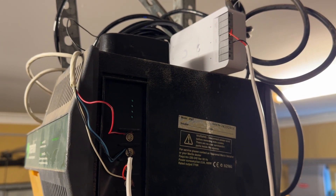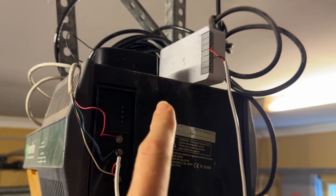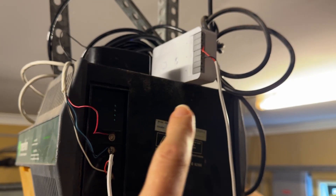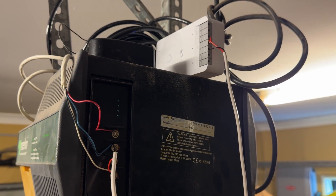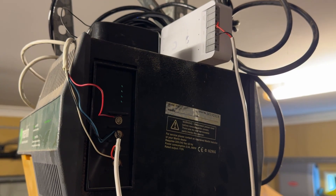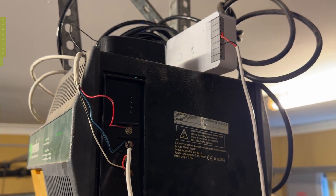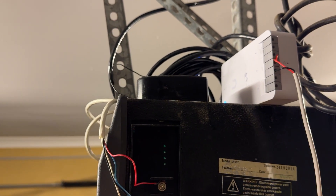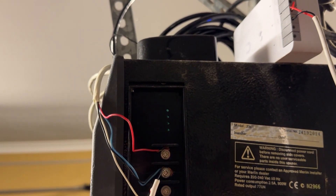It's super important that the actual device knows when to stop the door and has any other sensors. The door hub has no functions for that — it's not going to run this door for a certain period of time, it will just send a signal to close the circuit. It won't do anything about how long, it doesn't know whether the door is open or closed. For dry contacts, all I need to do is complete the circuit between these two terminals. If I complete the circuit — remember there should be no sparks — there's no voltage being applied, this is just completing a circuit.